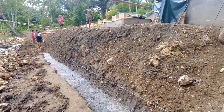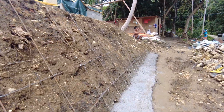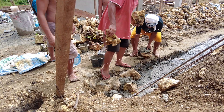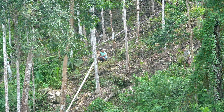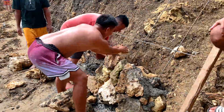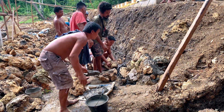Before we get to that, we have to make sure that the land is secure and there's not going to be any movement with all the rain and the excavator work. We wanted to build this rip-rap, which is a retaining wall. We've got a base of cement and we'll be piling local rocks quarried from the top of our property, stacking them up with cement and rebar to create this retaining wall for the safety and strength of the farm.